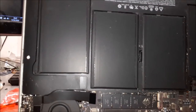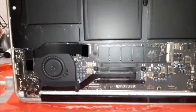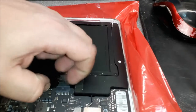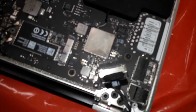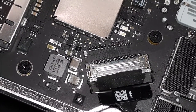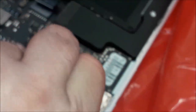You see the Apple try to refresh. Yeah. Once again. Let me shut down the machine. Now we're gonna remove and put back the LVDS cable to see what happens. Okay, the machine is off. I'm gonna remove the battery now anyway. The battery is off because I wanted to remove this LVDS cable. Let me check the condition. Looks nice, guys. Pretty decent. I cannot see corrosion over there, unless we have something on the other side of the board. Right now, let me take the LVDS cable and have a look.